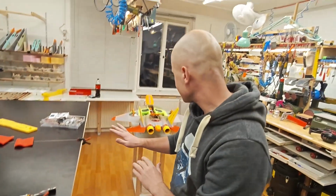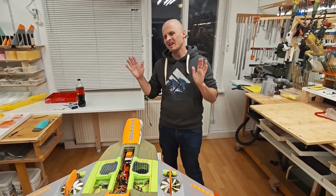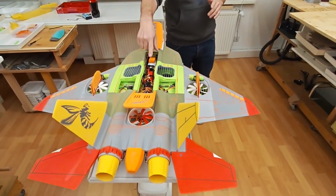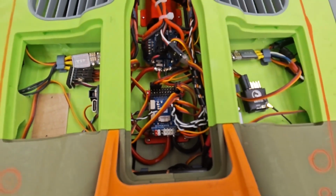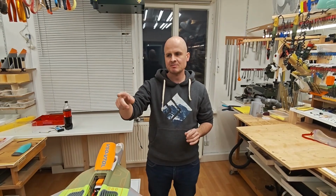And you know, we got a lot of servos, and especially during transition, when there is a lot of force on all these servos, maybe 5 amps could be a little bit less. And the next reason is we got 1 PWM output more on this board. So if you like to add some special function here, it is possible with the Matek board, which is not possible with the SpeedyBee. There we would need all outputs.